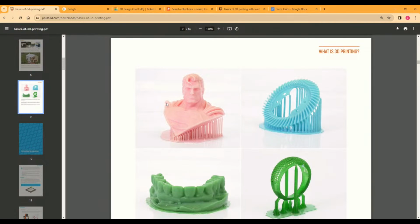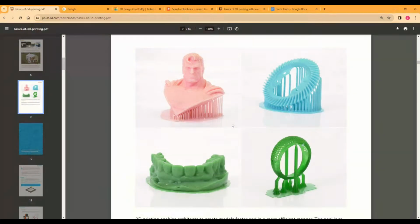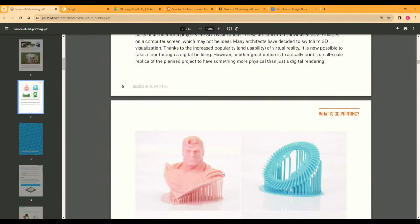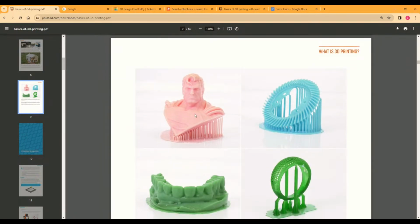With the resin, these are just very messy. You're going to go through boxes and boxes of rubber gloves and paper towels and jugs of isopropyl alcohol. So that's one thing to know, that pro and con here is when the FDM print's finished, you can pretty much pop it off the printer, and maybe you have to clean up some hairs of plastic. Maybe you don't. It depends on your print settings and how dialed in you've got the temperatures and everything. But for the most part, FDM is pretty finished if you don't mind the layer line look off the bed. If you don't and you want it to look perfectly smooth and painted, you have to do some filling and painting. But you'd have to do that on resin also to get the colors that you want, right? But you wouldn't have to do the sanding step as intense.